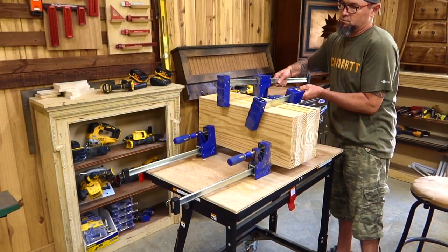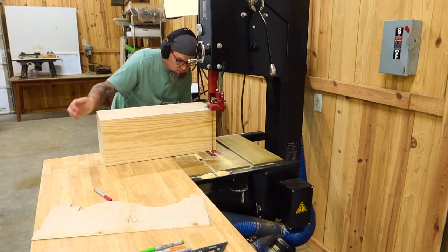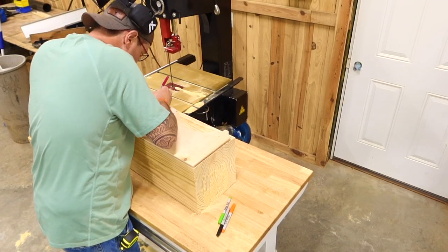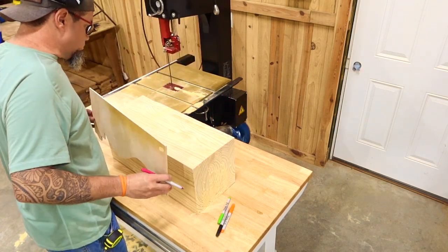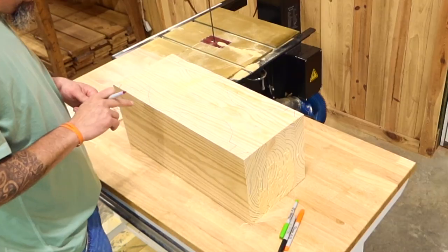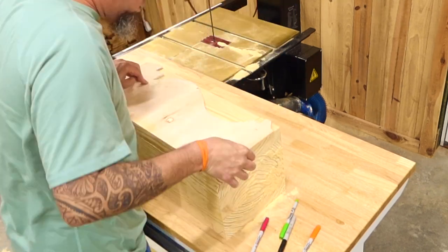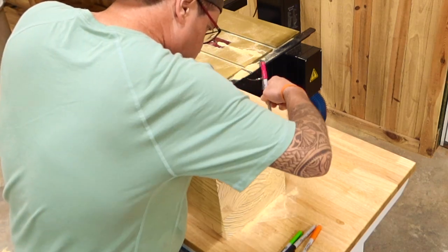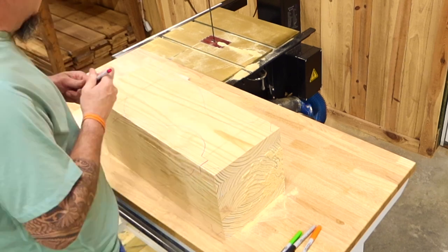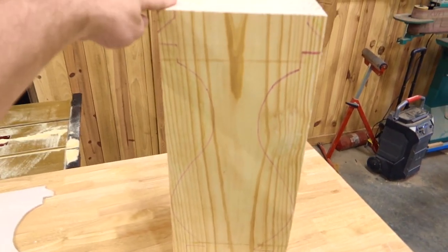At the bandsaw, cut the block down to exactly 22 inches — these ends need to be square. I made this template out of a quarter inch ply, exactly nine inches wide with the profile on one side. Just flip it over and trace the profile on the opposite side. We're actually going to turn this block over and over and put this profile on every edge. Take a different color marker and zigzag through the off cuts — the cutting method I'm going to show you will require you to re-glue these off cuts back in, so those little marks will come in handy.